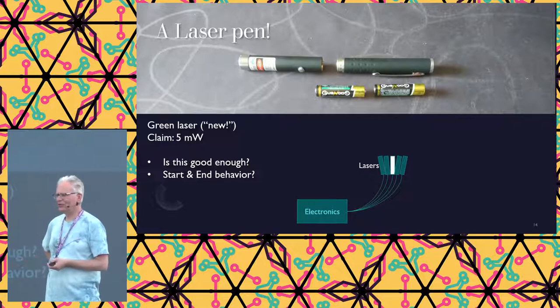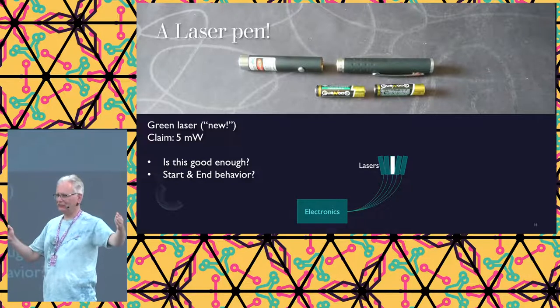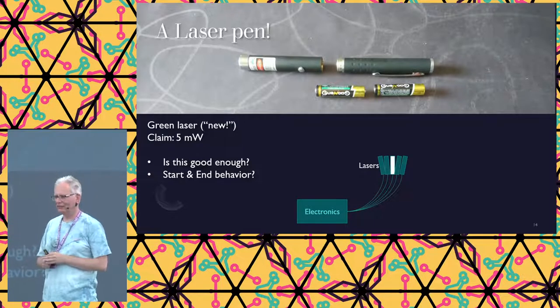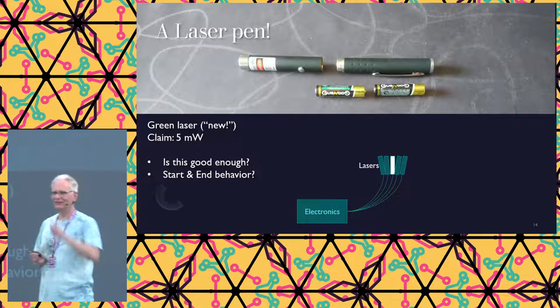That's a rather complicated device, though, because that means that you have a laser going out, and then it reflects against the wall, and it comes back, and then you have to measure the time of flight. We're talking microseconds. That is very complicated electronics to get right if you are a hobbyist. Okay?